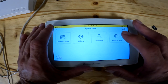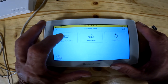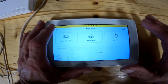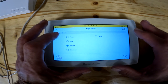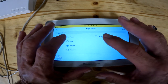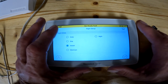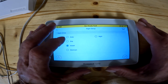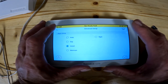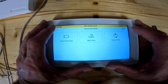The last thing to go over in here is the advanced setup. Click on that, enter your code. Once in advanced setup, this is your power mode setup — you can turn on power savings and it'll go to sleep faster. Your night setup: when you push night to arm the system, you can set it up to do different things. You can set the night mode to do stay or away, instant, or maximum. Maximum arms everything in the house including motion sensors. Instant puts you in a stay mode but leaves inside motions alone. Most of the time you don't want to mess with this setting. Keypad reset basically defaults all the settings back to normal — we don't want to hit that right now.